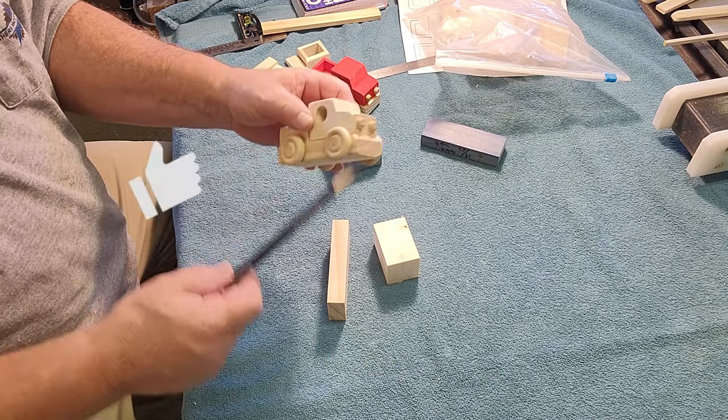See that? I drilled through. Hopefully you can see that. I drilled through, and there's a little hole on the other side of this block. So now, that tells me where I can start drilling from this side to get a nice clean edge around that hole. See that? I drilled from that side. Now I got a nice, clean, crisp edge on both sides. You drill one from one side, then you come back on the other side and drill it that way.